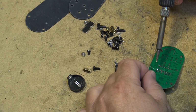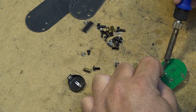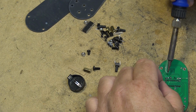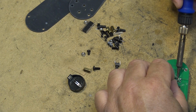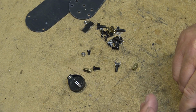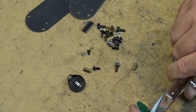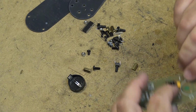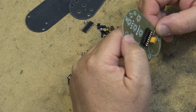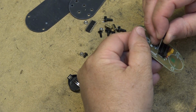Maybe we'll do a video on a remote control. Quite often what will happen to them is they will internally fracture the ceramic element. So if you look at your remote control using a camera, you'll see it still putting out a signal, but it's not controlling your TV or your whatever device it's for. It's because the crystal internally gets broken and it changes the frequency. And when that happens, it won't control your TV or whatever device you're controlling.